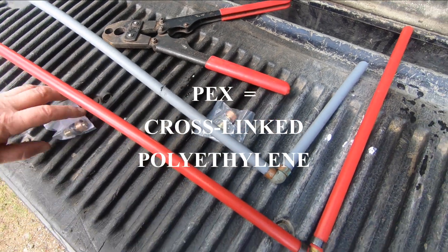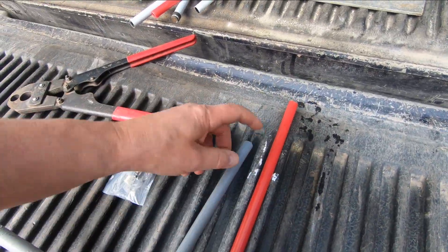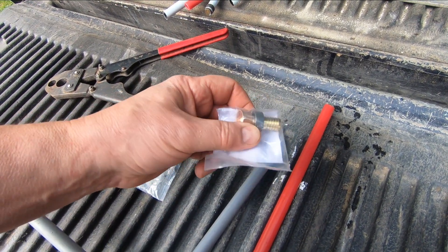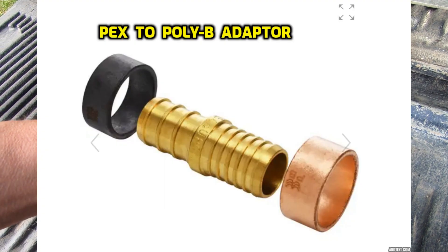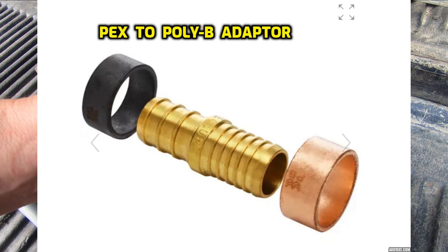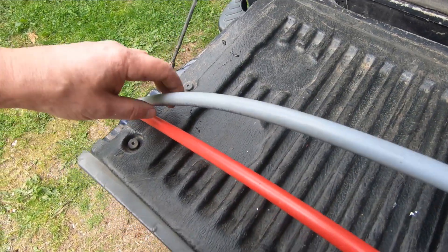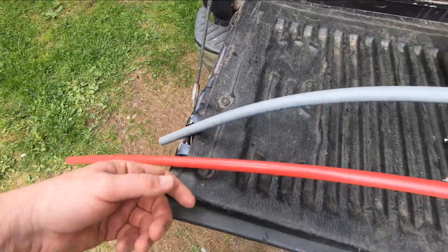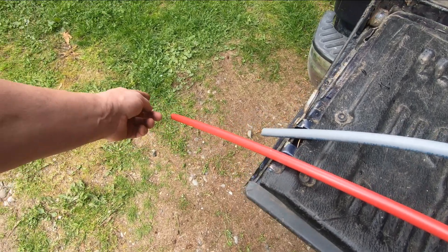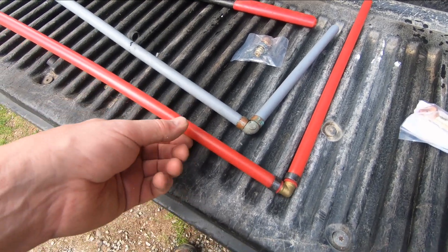What I'm going to do is join where I cut it off under the sink — which is poly B coming down to PEX. I've got an adapter here; this is a poly B to PEX adapter. You can buy these. You can see the difference: PEX on the left, poly B on the right. I cut this one a little longer because it's going to go down underneath the cabinet, come out around, and be joined over here. It's actually a hot water line.